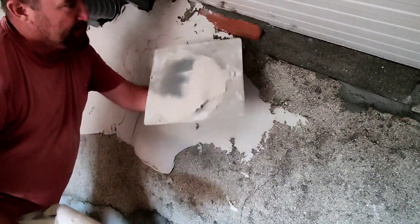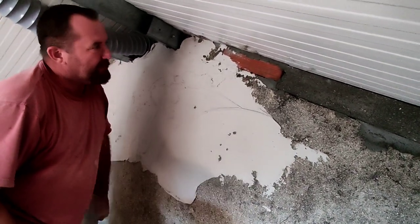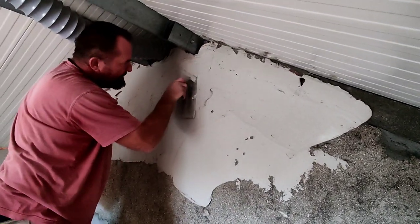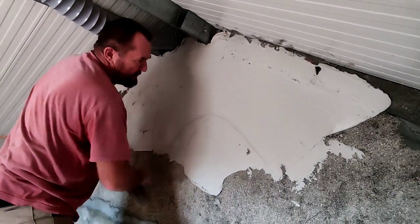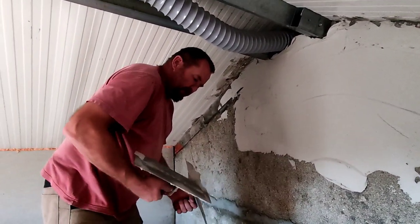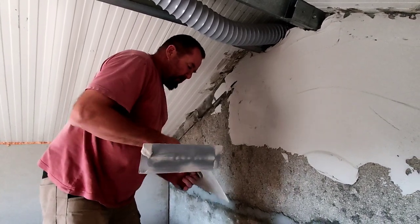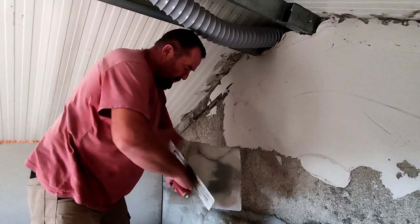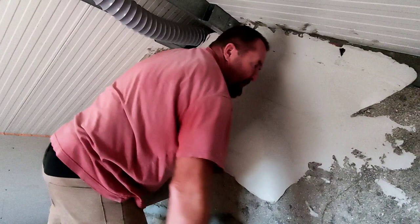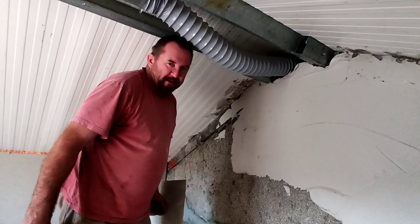You've got brick, clay, old render, bits of granite. It just sticks to everything. For you guys in the UK, the closest gypsum product to this, or British Gypsum product, would be a product called Hardwall, or sometimes Browning they call it, but it's basically a backing plaster for internal works, and I love it to bits.